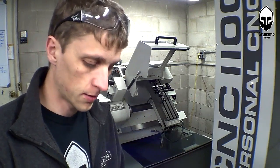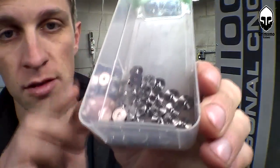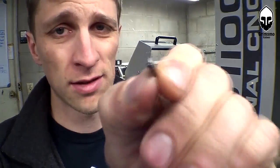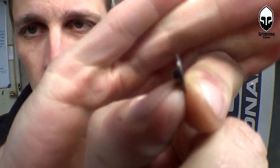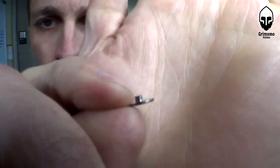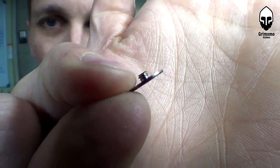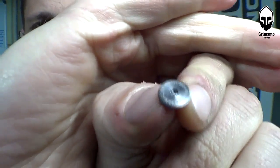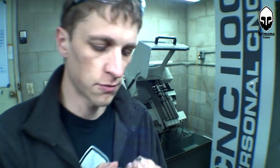I've had this lathe for a few weeks now and I've been playing with it. The first series of parts I made were these lock bar stabilizers — I made 50 of these. They turned out so nice. Basically it's a tiny little screw: 4-40 threads, really short, and then on the mill I flipped it over and milled a torx pattern into it and did a little engraving. I didn't do a lot of filming while making these, but all 50 that I made were within a few tenths of tolerance without even really trying or having much experience on the lathe. I'm really happy with that.